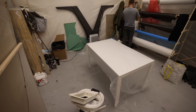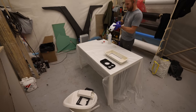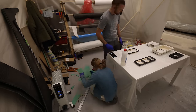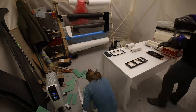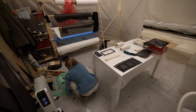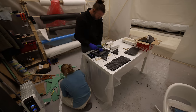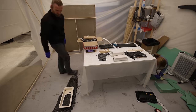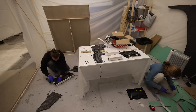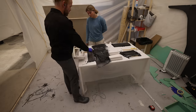We went through a few renditions of how we wanted to do this. Originally we thought we'd just put a single layer of carbon fiber skin over the part — they call that skinning, it's really just a superficial cover that makes it look good. But these parts have some really odd complex curves, and all our scrap carbon is a super heavy big twill. There's really no way it can make those curves and look good without big gaps. So what we came up with was to make our own flat sheets of cured carbon, cut them into rectangles, and lay them inside the part. The parts not covered in carbon we will paint black. At least that's the plan, and that's what I'm working on right now.